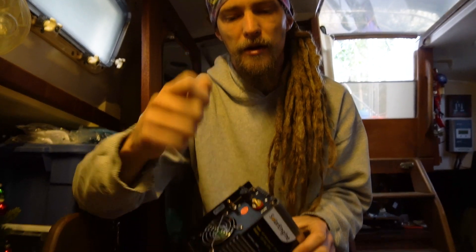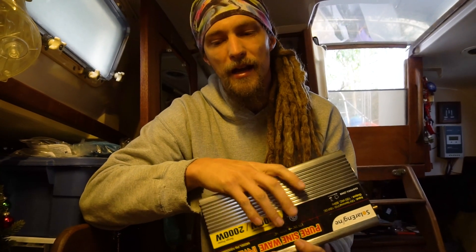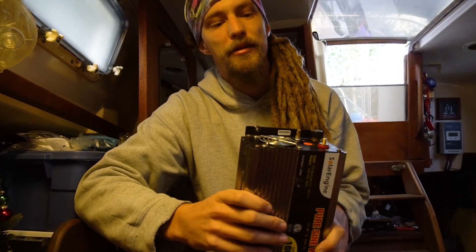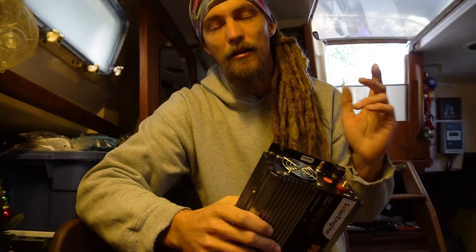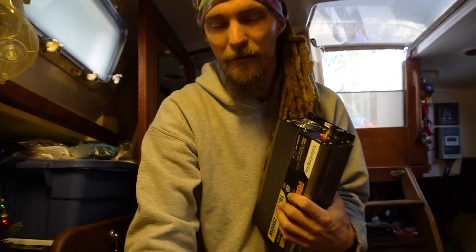There's a capacitor inside of this inverter, so when you hook it up you end up getting a spark. The preferred method is you hook up your terminals so there's no chance of them touching, then hook up positive then negative. The way to avoid the spark is to use a little resistor — connect it with the resistor for a second and it charges up the capacitor electronics inside, and you won't have the spark. Since I don't want to spark our new batteries, I'm just going to charge the capacitor quickly by hooking positive to positive, negative to negative on our old batteries. Charge the capacitor and then it'll be ready with no sparks.